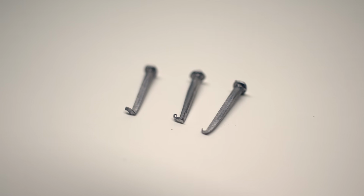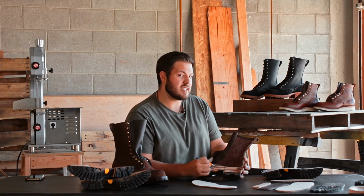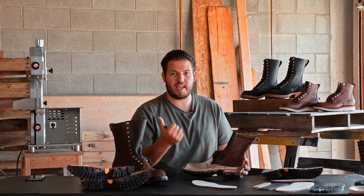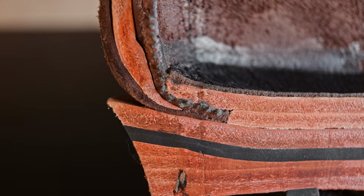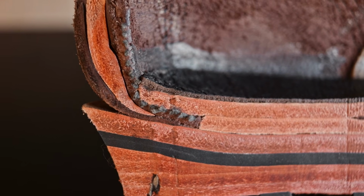And so it won't hurt anyone who is wearing it, obviously, but you can see the heads of the nails in the insole. So we put this sock lining for two reasons: A, for it to look nice, and B, so that over time, the natural sweat or perspiration from your foot won't touch the tack or nail, so it won't rust or anything like that. So that's one of the reasons for the sock lining, and it actually works pretty dang good.